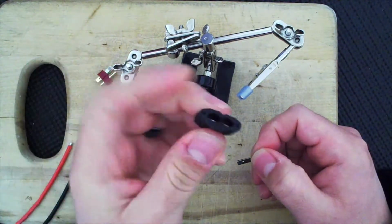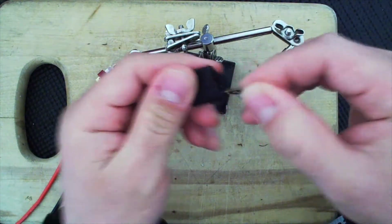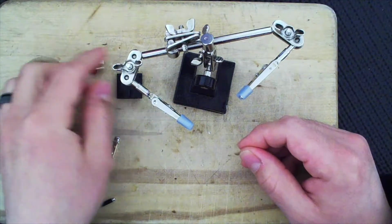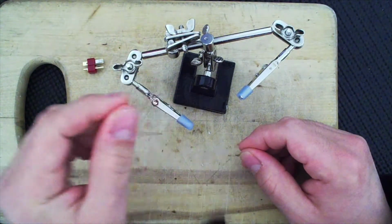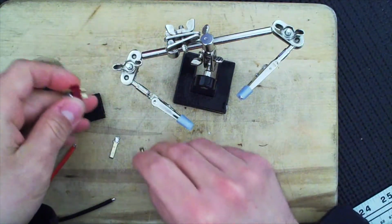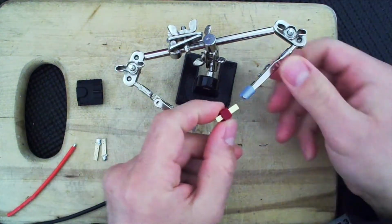Versus Traxxas, it has to do with this here. You see that the spring is on top, and then this will slide in, but here it's loose. You actually need the other plastic backing, and that's what's going to produce the friction. So I do think Deans are a little better, but what I do like about Traxxas is that they're a little further apart when you solder the wires. So the wires would go in there, versus Deans, they're pretty close, but still not a big deal. They both handle up to about 60 amps of current. If you start going over that, you're probably going to melt something.